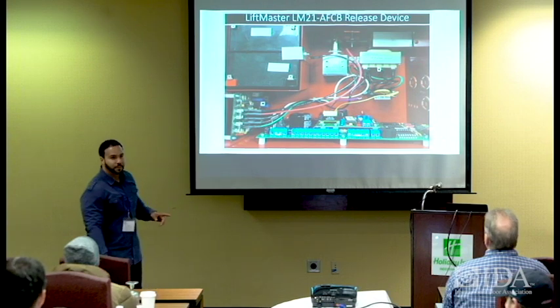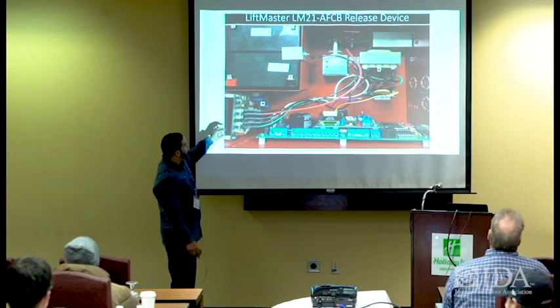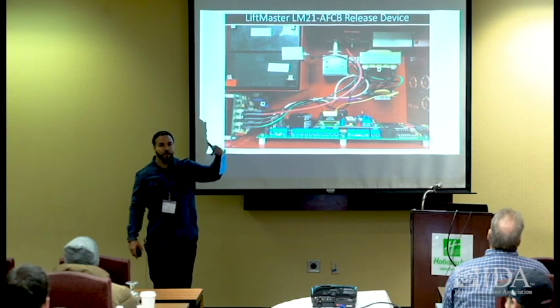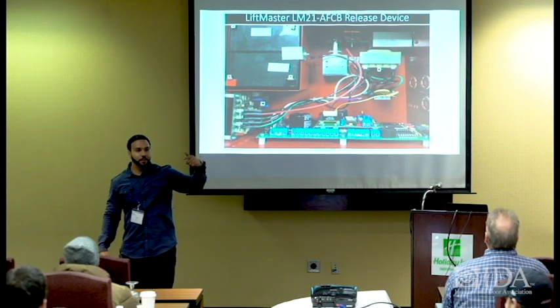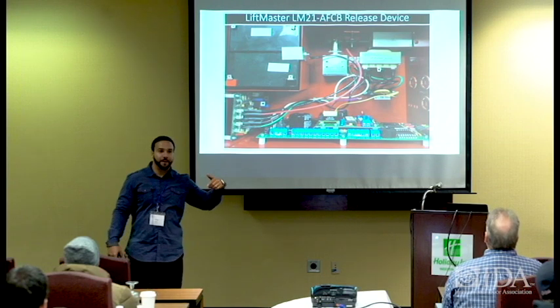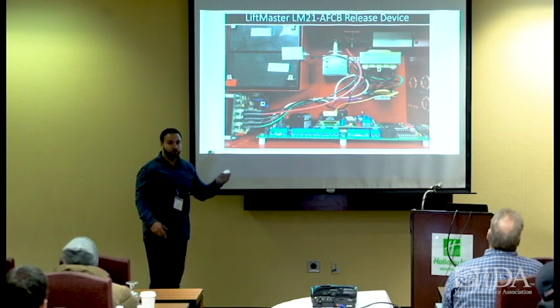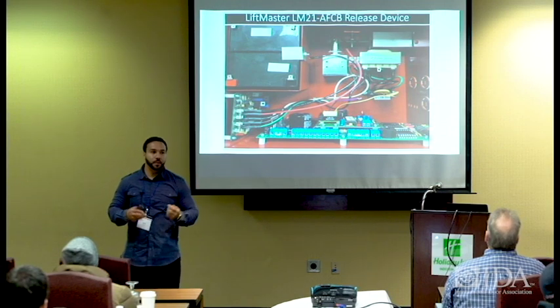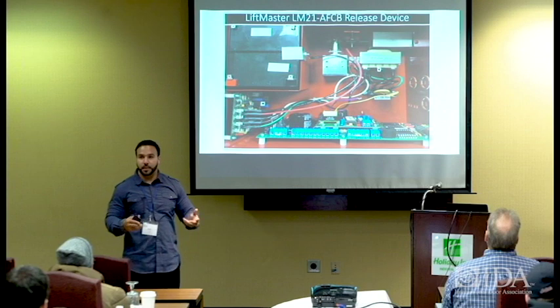I don't mean take your meter and put it right here. No, take the fuse out, because your meter can create that circuit, and then that voltage can go through your meter, the amperage can go through your meter and actually damage it, okay? So I mean, take the fuse out, test it on each end, and check for continuity. You get a beep, it's a good fuse. You don't get a beep, it's not a good fuse, okay?